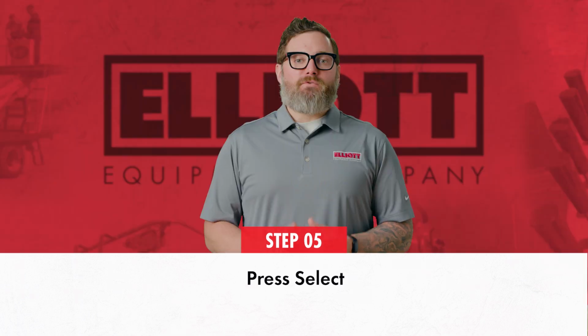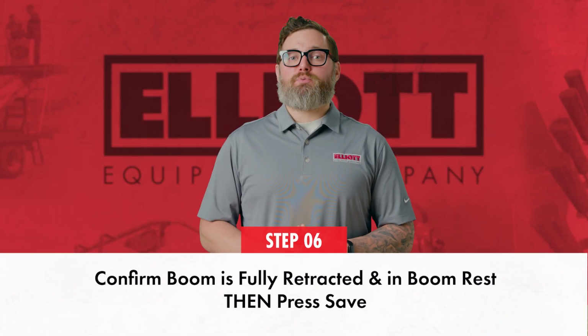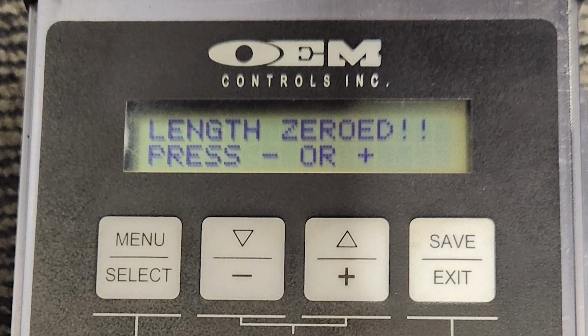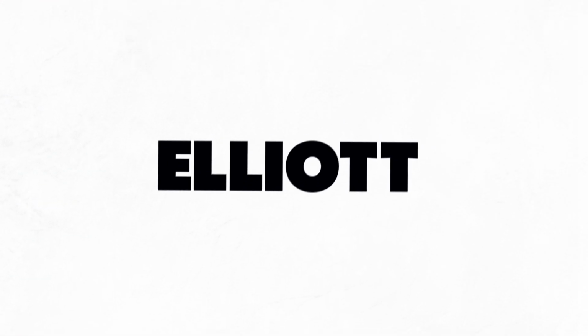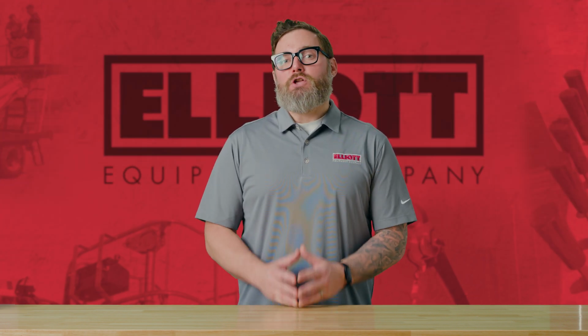Press select now. From there, you're going to confirm the boom is fully retracted and in the boom rest, then press save. Now the screen will read length zeroed, press, minus, or plus, and then you can press exit to finish. All right, now that you've zeroed the length encoder on your V60F V1, you ought to be good to go.